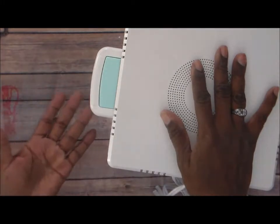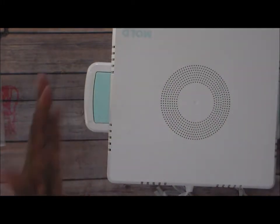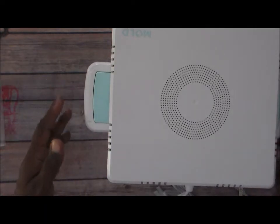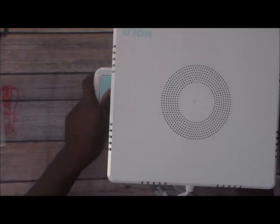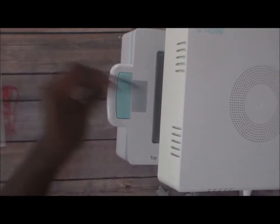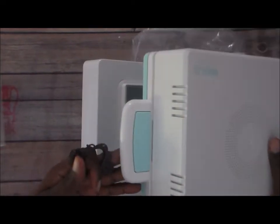It melts the plastic. And from what I understand, you'll know when it's time to drop it down, because the plastic in there starts to droop down. They say let it droop. It'll start to droop like for an inch or something like that. Once it starts to droop, you pull it down. And once you bring it down like this, the vacuum will suck the plastic around whatever you got in here.